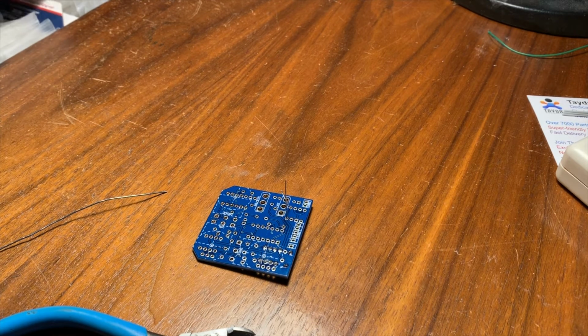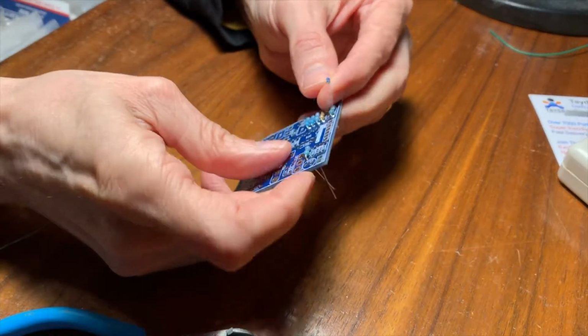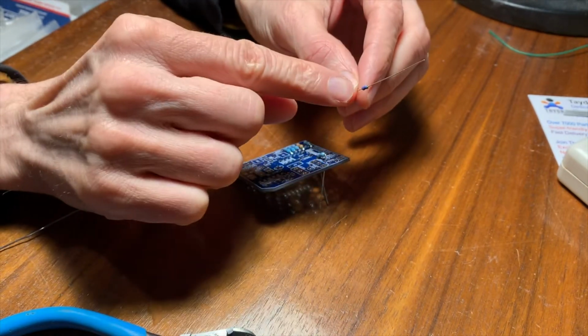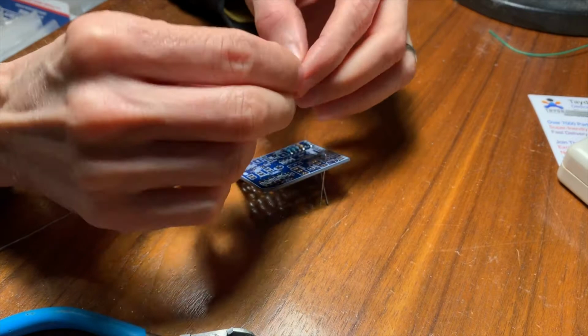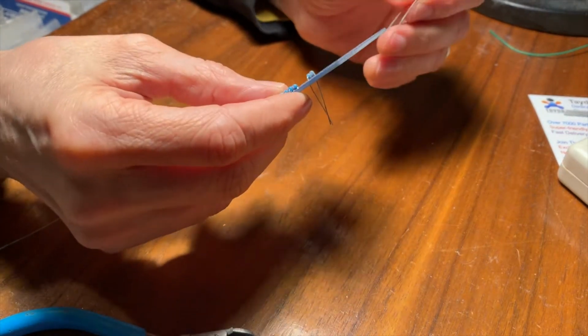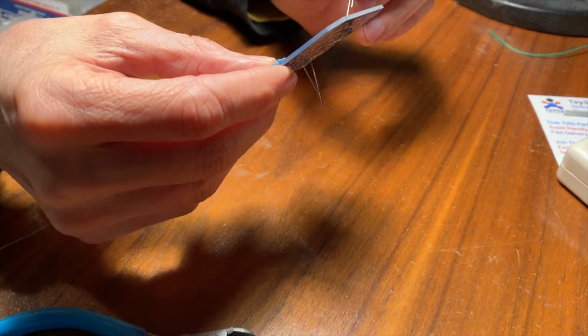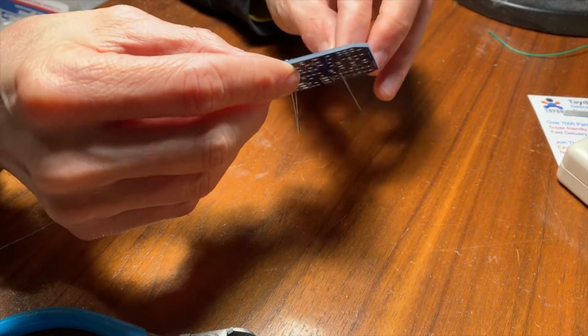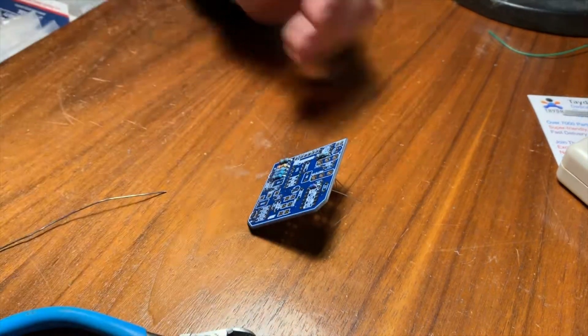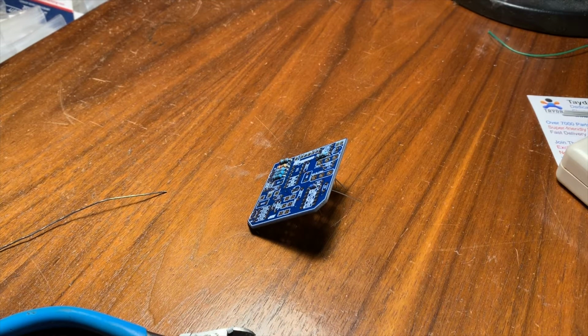I need a 47K resistor and I don't have it. So these larger parts right here are 1/4 watt, and these smaller resistors are 1/8 watt. But for this circuit, the 1/8 watt resistors are fine. So I have a 47K in the 1/8 watt size, so I'm going to use that one for R7. These small ones are good if you're trying to fit a circuit in one of those little tiny boxes, the 1590A. So I've been buying the 1/8 watt resistors lately because they're better for those.